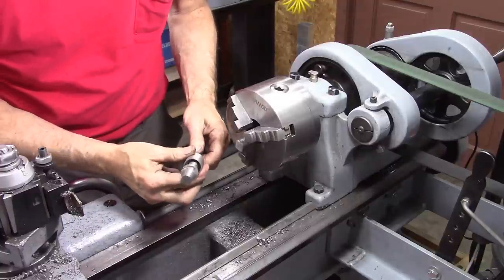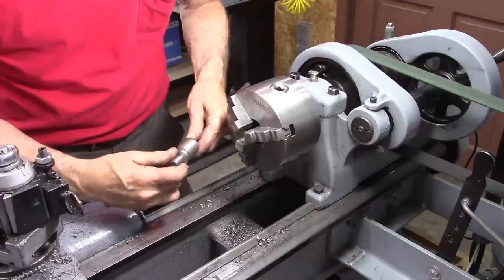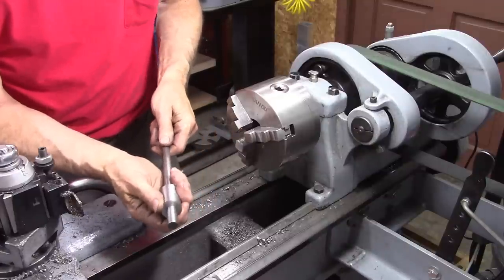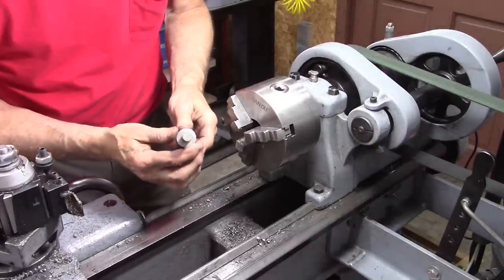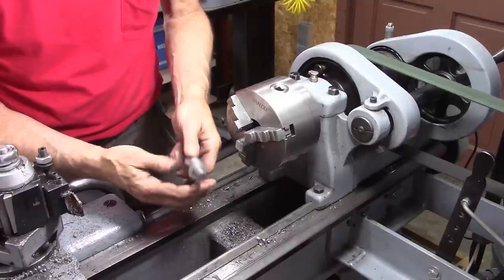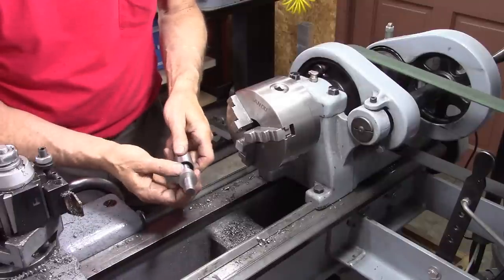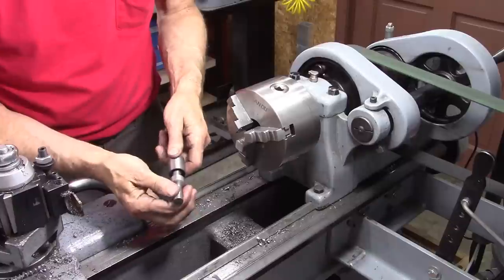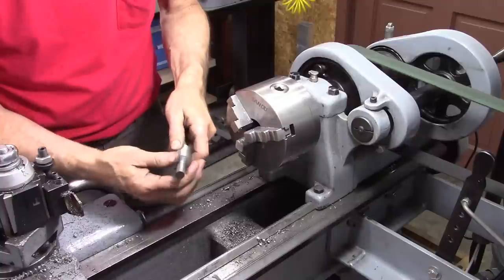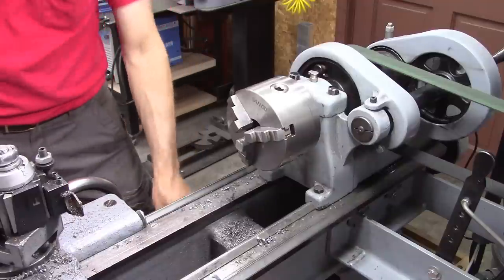Okay, here's the way it works. This goes in here like that. This goes on here. It gets welded around the perimeter there. It's held captive in there. And then I pin weld a nut onto the top of that. I was going to put a brass thrust washer in there. Gonna have to be fairly thin, either that or cut this down. I think I'll just make a thin brass thrust washer.